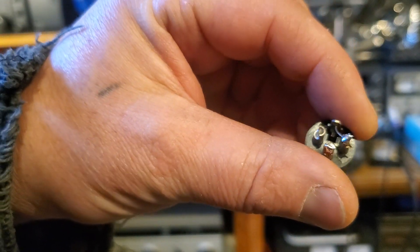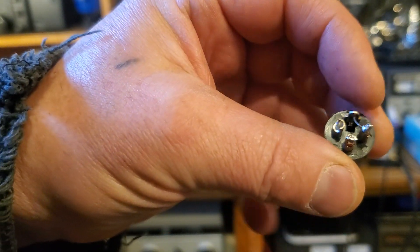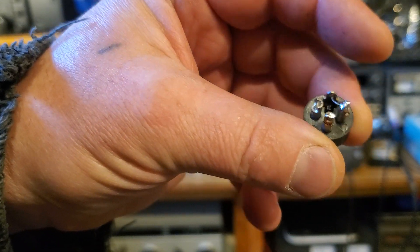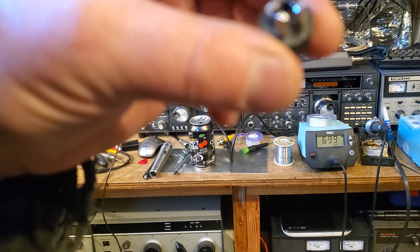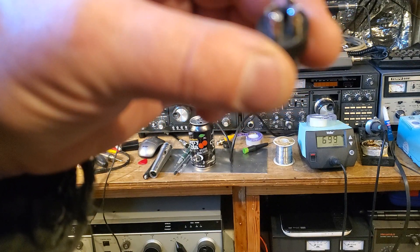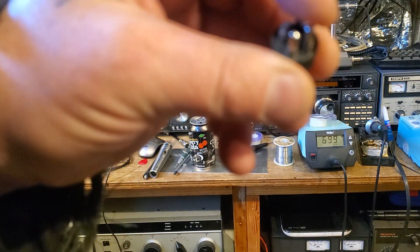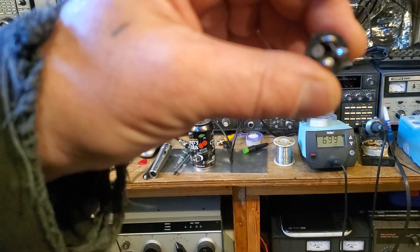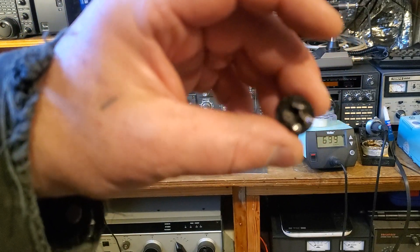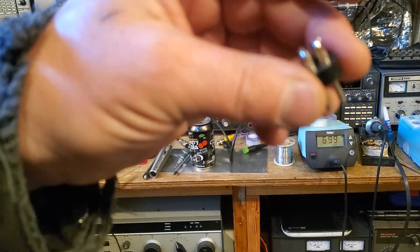This particular microphone being high impedance is not a balanced input or output. You get the ground tied to pin 1, and they have the signal going on that also, and then pin 3. What it should be is pin 3 and the other one that's not soldered — and then this one should just be grounded.